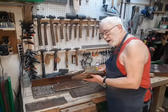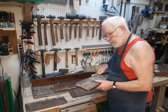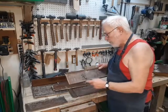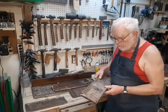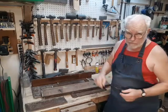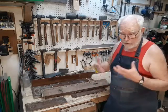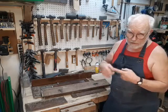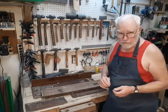This drawer very possibly could have been made in a furniture mill where all the machinery was powered by a water wheel. The water wheel would have driven a long shaft that went from one end of the building to the other, and large flat belts went down from the shaft to each individual machine. You can imagine something like that — pretty lumbering and slow. And that's basically why they couldn't get shaft speeds fast enough to turn little small bits like we have on modern day routers.